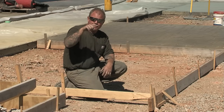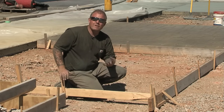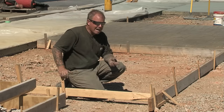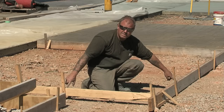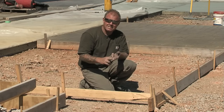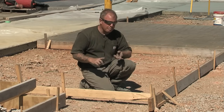If you have a driveway — maybe a two or three car garage — that has jog-ins and you can't use a diagonal like this, we use what's called the 3-4-5 method. You can scale this concept up indefinitely by doubling it: measure 3 feet in one direction, 4 feet in the other, and for a true 90-degree intersection you should have a 5-foot measurement across. You can double that to 6-8-10, or 12-16-20, depending on the size. So remember, square your forms on most of your stencil and stamp patterns.